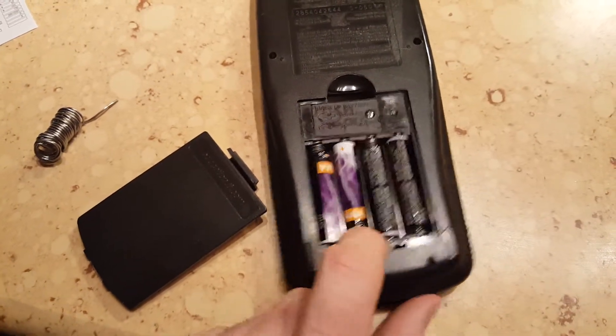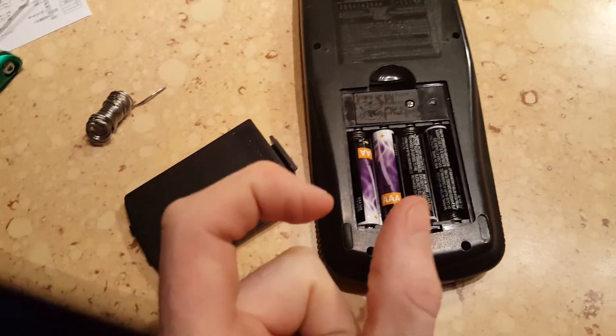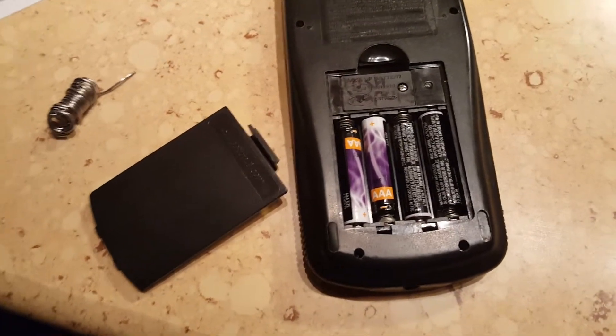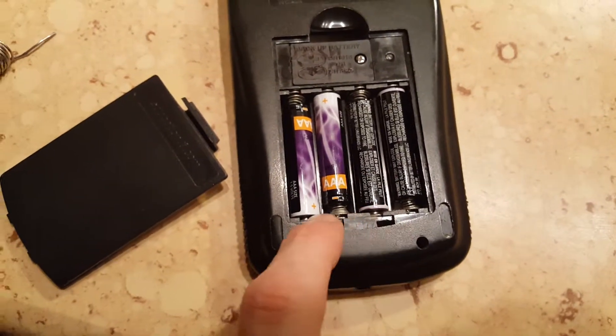On the motherboard there are little gold rectangles for the contacts that get worn through, so the connection is no good. I just applied a layer of solder under there — it's right under these two openings right here.